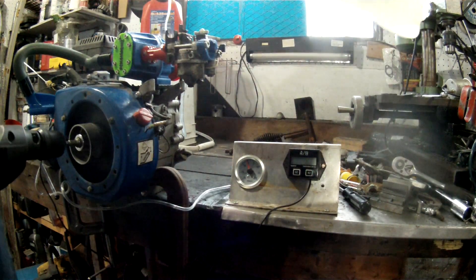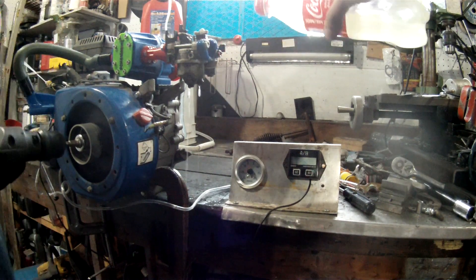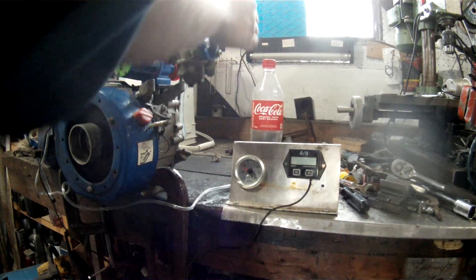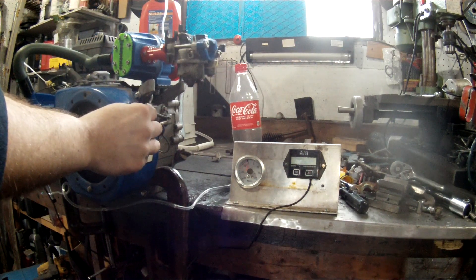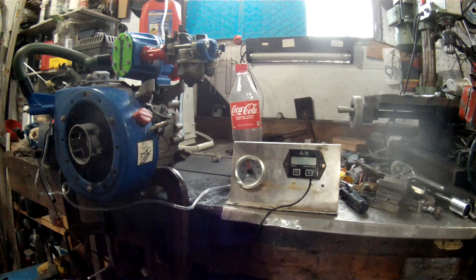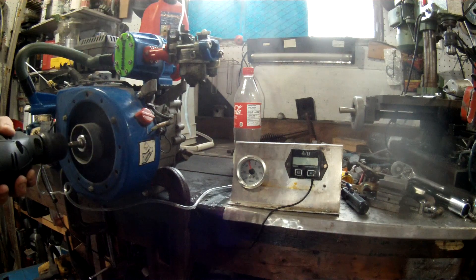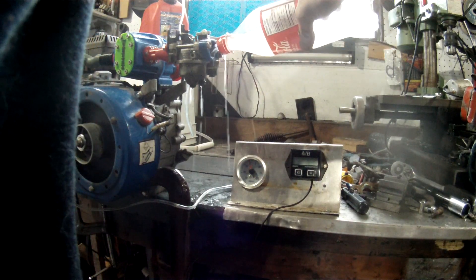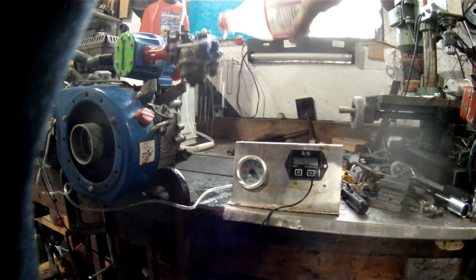Success — which definitely means it's a fuel issue, which I figured was going to be the case. I'm still going to see if I can do some boost runs. I've tossed an elastic band over the throttle stop to make sure it pulls back to zero when I let go. What I'm going to do is try to continuously manually fuel it — manual fuel injection — at least long enough to do some RPM pulls and see if we produce any boost under no load.